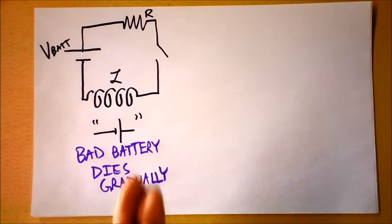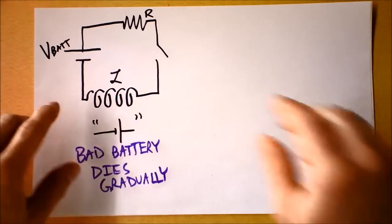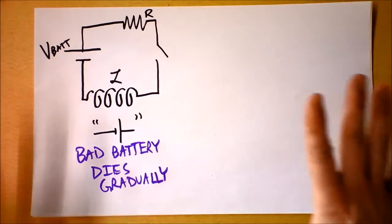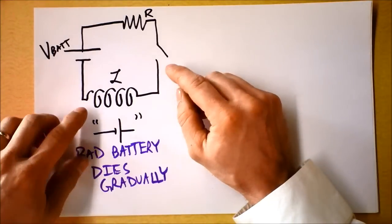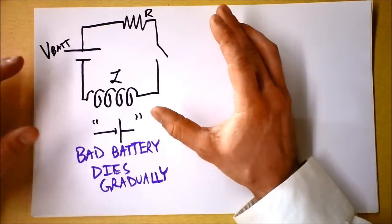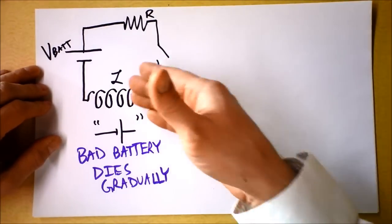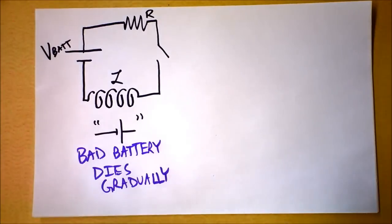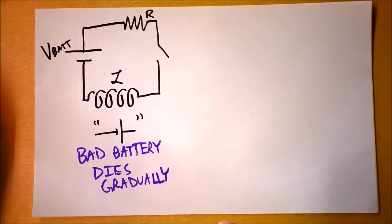Ultimately a current will be allowed to flow because there's some resistance here and everything kind of eases into it — it's not a perfect inductor. I want you to notice that the inductor is kind of like inertia in the circuit, because it tends to not allow a change to occur. This is very similar to capacitance, but I like to think of an inductor as current inertia.